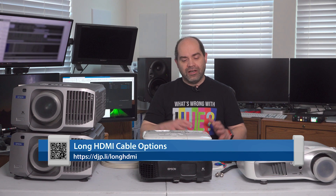That's nice and easy. However, that isn't always going to be the case — particularly with projectors that are permanently installed, or maybe they're a little older and don't have HDMI, or they're not using HDMI because HDMI doesn't actually travel long distances. If you're trying to do a long signal run, HDMI is not your best option. I have an entire video on doing long HDMI signal runs — there's a link in the video description. HDMI is really not ideal for long runs, so we want to come up with something else.